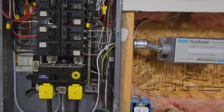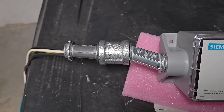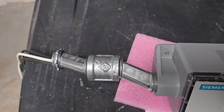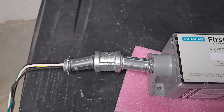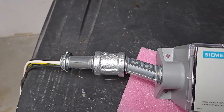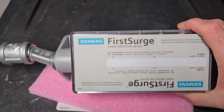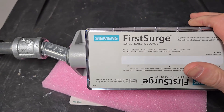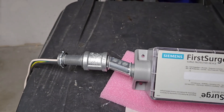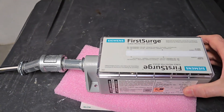I was able to put this down on that bottom right section with ease. The configuration I came up with is to use two offsets with a coupler, and this allows me to get a little further out from the wall. This could have been done with flexible conduit, probably quite easily in one piece. But I actually do like the idea of the rigid mount because once this is attached to my load center, I'm going to want this to stay put. I know it's going to sag a little bit until I have the flush mount kit attached and screwed into the wall. But it is possible one day that this could get damaged and need to be replaced, and with this configuration it's going to be very easy to just slide the whole thing out as a unit without having to open up the drywall again. At least that's how the flush mount kit is designed.